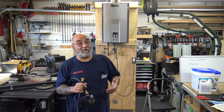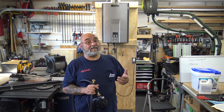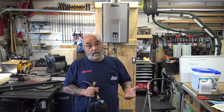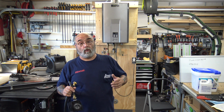We didn't read all of this fine stuff in the manual about how many gallons per minute. These companies didn't have these products, so we were using a pony pump, and we were only getting a few services out of them. We'd take it apart and found that the impeller was just muck in there.